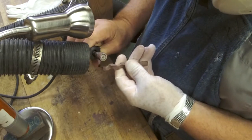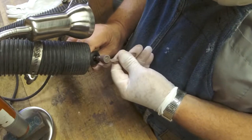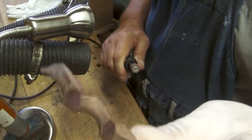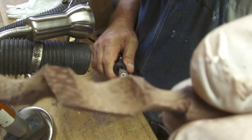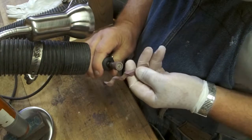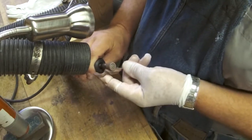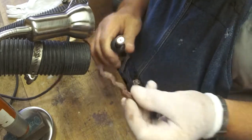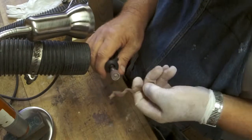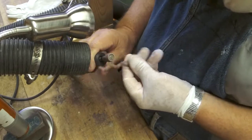All those square edges along that blank piece of wood are now getting curved over. We're speeding it up a little bit here. Takes time. There you go. I'm showing you that the inside of the spiral is being rounded at this point. So it's all the flat edges on the inside of the spiral. And you'll notice this whole thing has been done with just a Dremel and a 60 grit sanding disc. Speed number 2. And it's a matter of repetition.